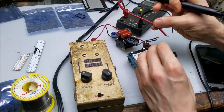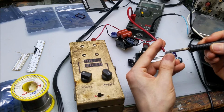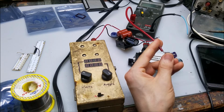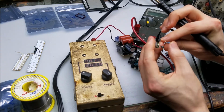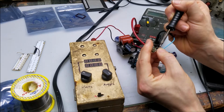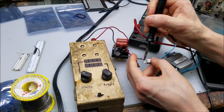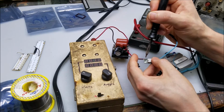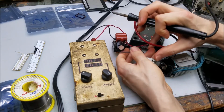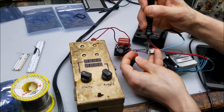Alright, and then we're going to hook the meter positive side of the current sense loop up to the negative of our load. Probably should use some more solder on there. Will it hold? Yes, it does. And then the common of the multimeter up to the cathode of the laser driver output, the negative. Perfect. And we're going to connect the power up to it, so negative to negative of the input to the laser diode driver. Perfect. One more wire. So same setup as I did with the boost essentially, and we're going to get a good idea of how this performs.